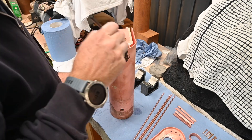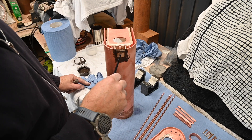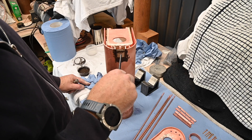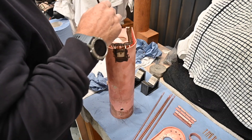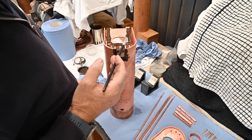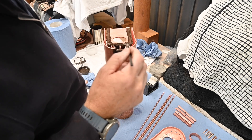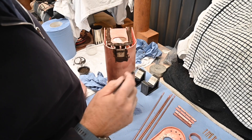It's a little over the place. It doesn't matter about getting flux to run down through this rivet because the rivet is only holding this plate on so that it can be silver soldered — that will be drilled out as a 3/8th hole to drill in there later on. I've just put some flux around these old joints just in case they start to dissolve again, which they probably will, but this will just stop the metal from oxidising around them and allow the solder to actually flow and stay roughly in position. That's the plan.